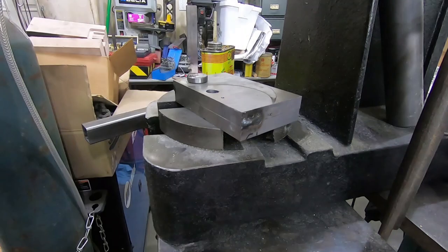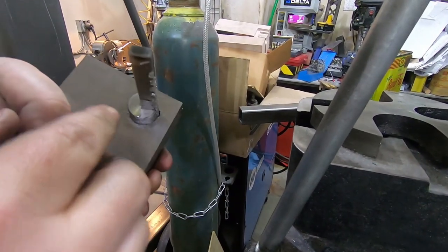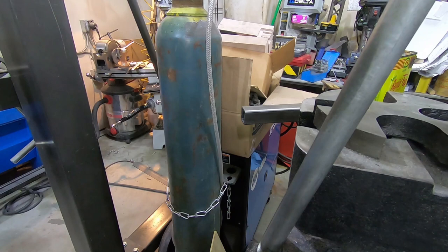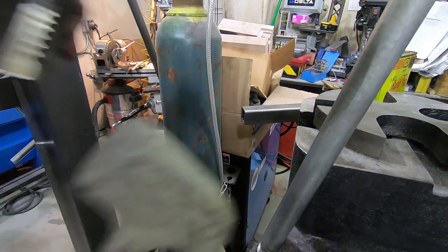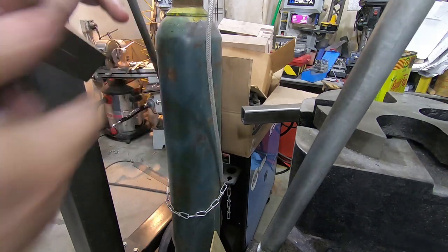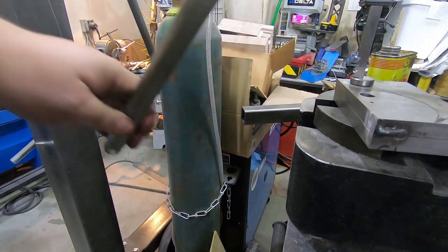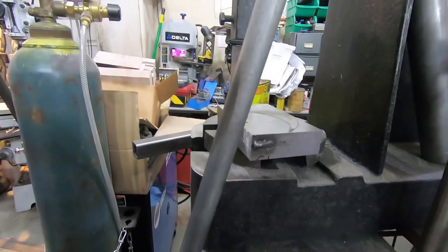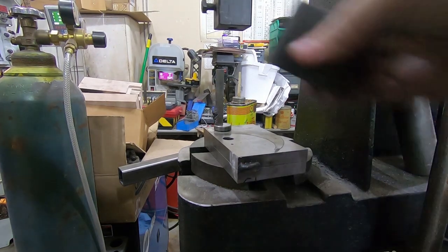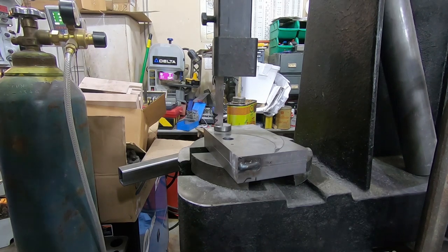I just have to take it out every now and then. Let's see here. Okay, that isn't so bad, but there starts to be a gap forming between the guide and the broach itself. And so I've just been whacking it back a bit with a dead blow hammer. So it's going. This is pretty tough steel after all, so I'm actually surprised it's going this well. And of course, using spacers. Oh, great. Just two back. Using spacers is important because I don't have one of those nice ratcheting arbor press handles. So I only have really good power through a small section of its stroke.